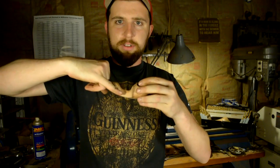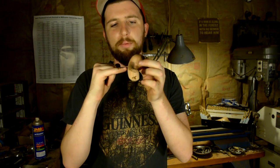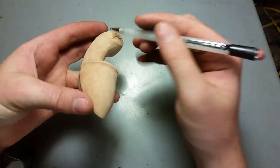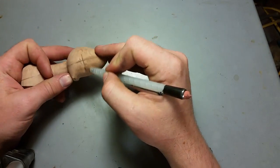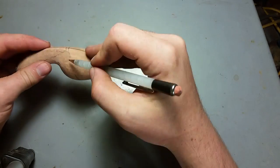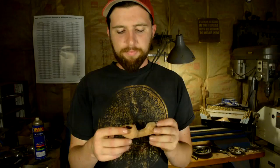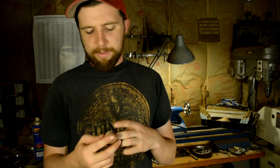Once you've got your bisecting line, you can start adding the angle of your mortise. I'll draw that line perfectly straight and perpendicular to the bisecting line. Once I'm happy with the angle, I'll draw the line for the chamber — also perpendicular to the bisecting line. Here you can play around and adjust the placement of your chamber to suit the shape, which is why we drill this way.